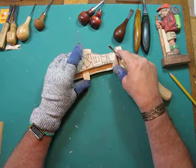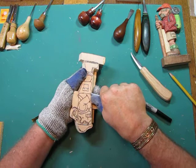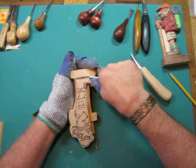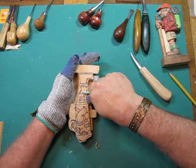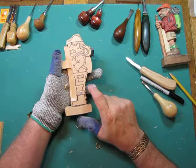Occasionally you'll see me without mine and you need to yell at the screen, 'put on your glove, dummy.' I'm going to make five cuts — one across the carving with my V-tool separating the jacket from the shorts, one cut across the bottom of the boots separating the boot from the base, a cut across the bottom of the shorts, and a cut across the top of the sock — which is synonymous with the top of the boot. I've done that so I can go to the point of starting to round.